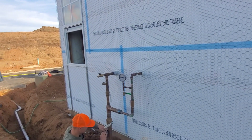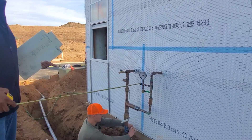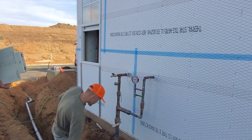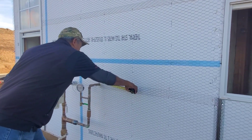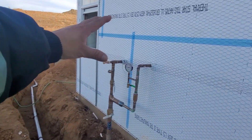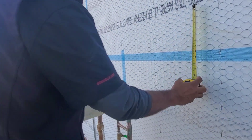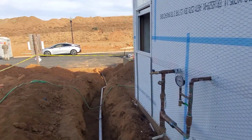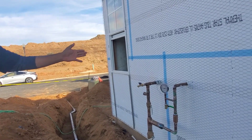The landscaper will use this area — there will be two valves set here: one valve for drip irrigation and one for sprinklers. Main water shut off is right here, no tools needed — turn that and everything is off. The landscaper will install his own ball valve so if you do some landscaping you can turn just that water off without shutting off house water. The fence line is about one foot back from here, so all this equipment is before the fence and stays accessible.